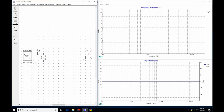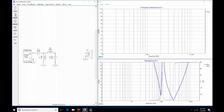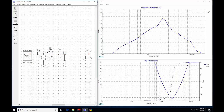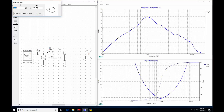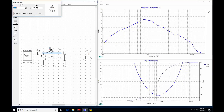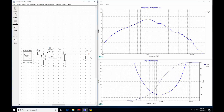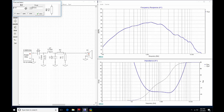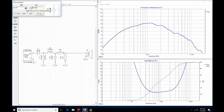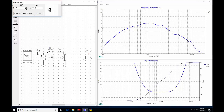I dropped the measurement files into XSim to see how well this driver behaves in a crossover. It needs both a high-pass and a low-pass to cooperate as a mid should. It has a ton of sensitivity, which makes it easy to shape into almost any target, though it will probably require an L-pad depending on the woofer and tweeter you use — which is fine. It comes into shape fairly nicely without much effort. These measurement files are available to download from the link in the description via my Dropbox, so you can try it yourself in XSim or any other software.